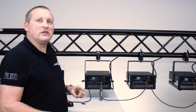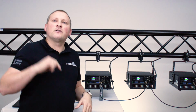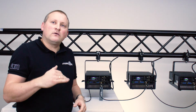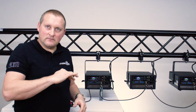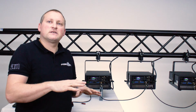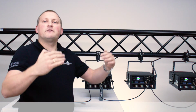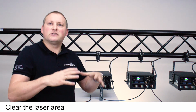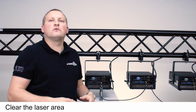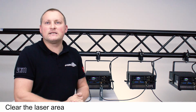If you have the situation that these lasers are hung high up and somebody's standing on the ladder and mounting everything, I would now shut off the power again with an E-stop, in this case E-stop the whole system, then have the keys turned, everybody come down from the ladders, everybody come down from the mounting situation, and then we apply power again, just to make sure that no glitches happen, nothing can happen at all in terms of laser safety.